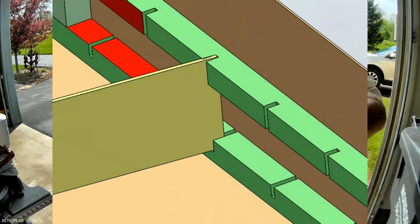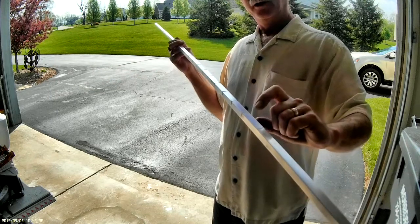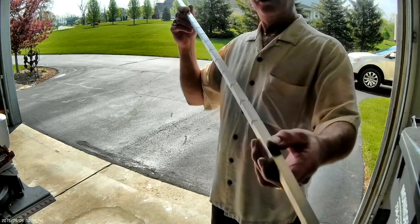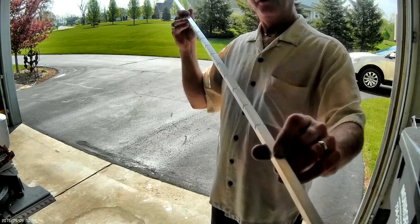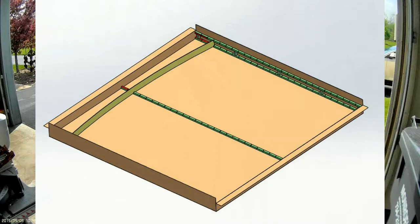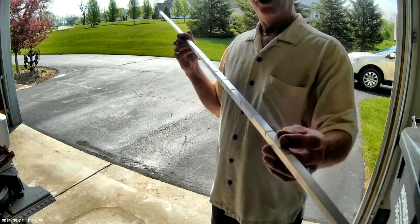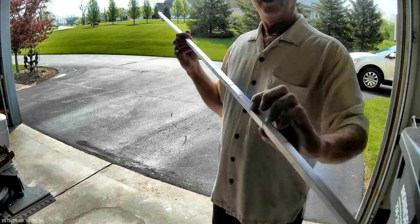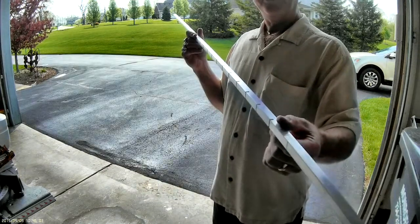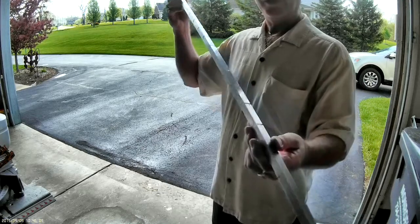The top one fits into the bottom groove on the bottom one. There will be some welded aluminum standoffs, so the structure will become kind of like a truss with a couple of standoffs, and then one in the center for support. The slats will fit on both sides in the center and they'll be curved slightly, with about a two-inch offset in the center, to keep straight cuts from cutting right down the line of the slat.